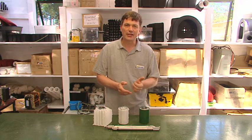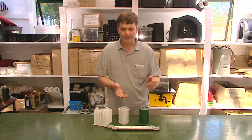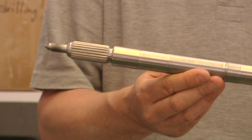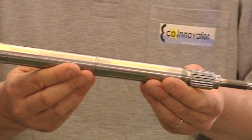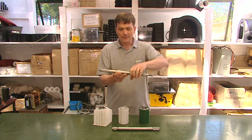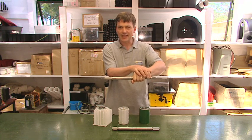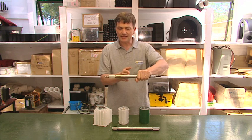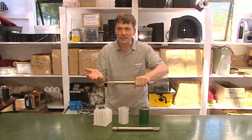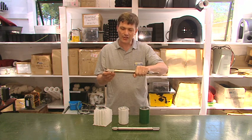The other thing that's changed over the years with the Smart Drive has been the shaft. The Smart Drive shaft is quite impressive — it's 25mm, which is 1 inch, and it's stainless steel. Only this half of it is used inside the bearing block, which means you have quite a lot of shaft available if you want to attach a wind turbine blade or a Pelton turbine rotor, making it very versatile.